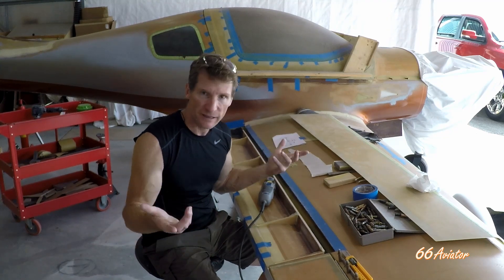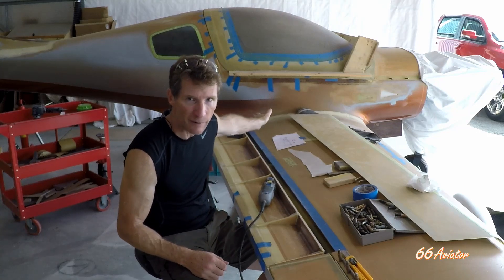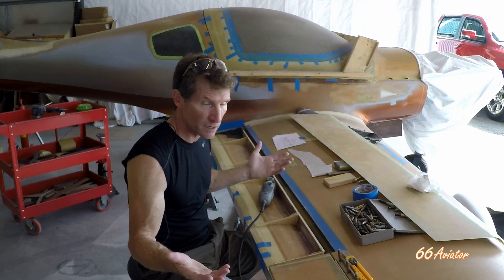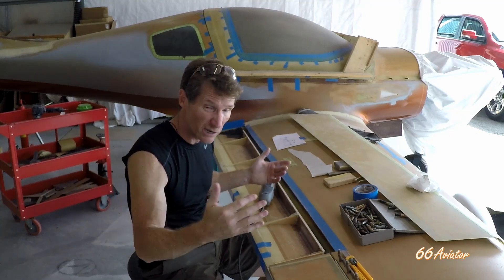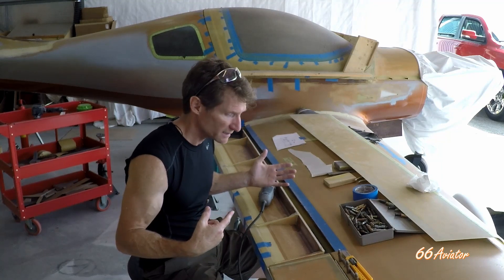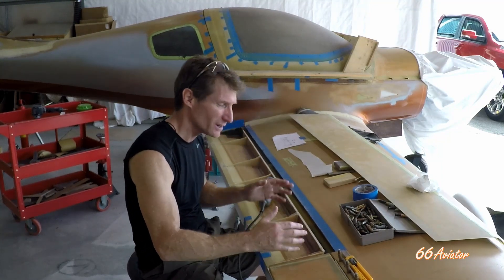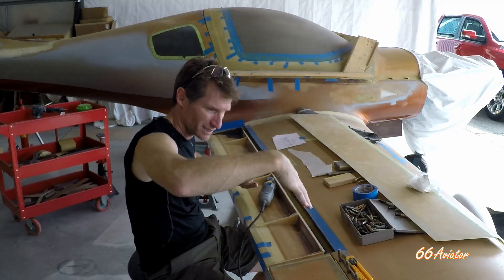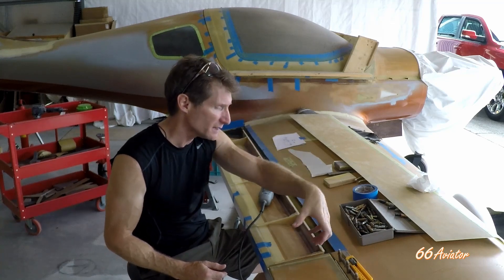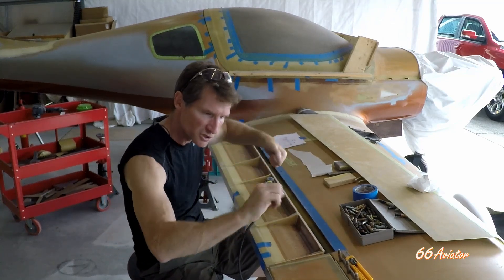The reason for that is because all of the force — the control rod for the flap — is on the inside all the way down here. You're coming in on final somewhere around a hundred knots on this plane. That's a lot of force out here on the outside. You don't want that flap twisting at all in the wind. That is why there are so many layers along the front of that flap, to make it as strong as possible so it won't twist.